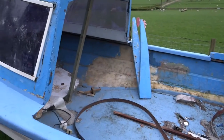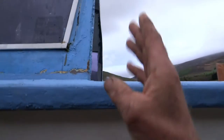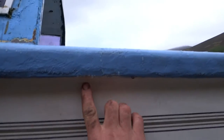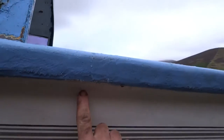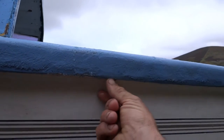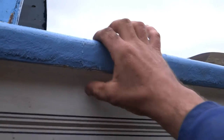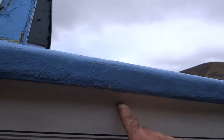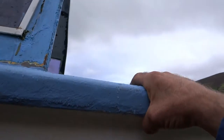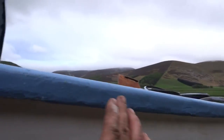For the stay connections, what I think I'll do is just drill straight through this, bolt through with an eye on top, and then maybe add a large washer or a stainless bar or something here, just to spread the load over this corner. That corner's a pretty strong profile, and this is now bonded to there so it's well solid, which is awesome. There's still the rubber trim to put back over the top of this and we'll be good.